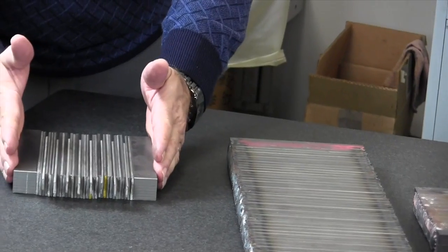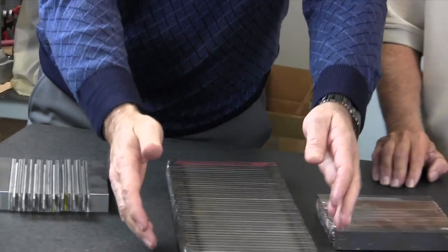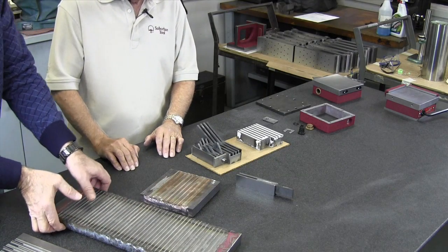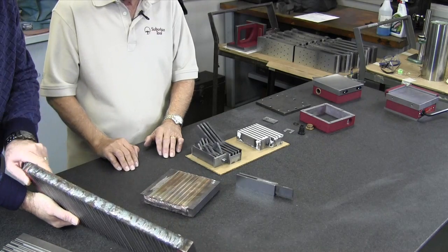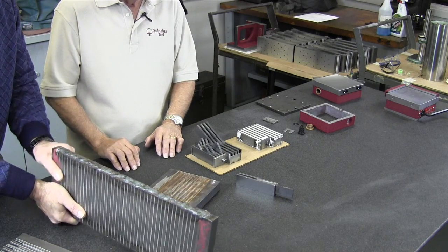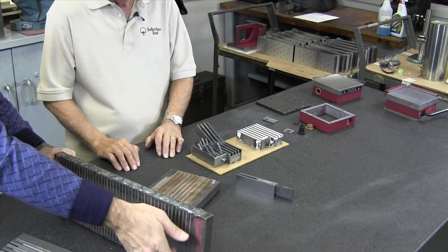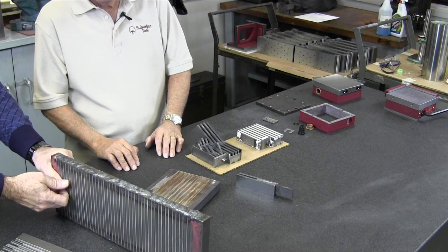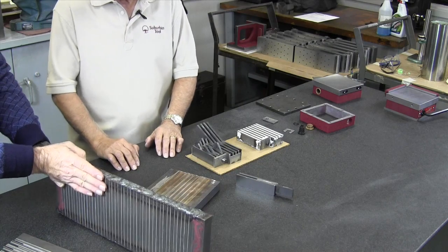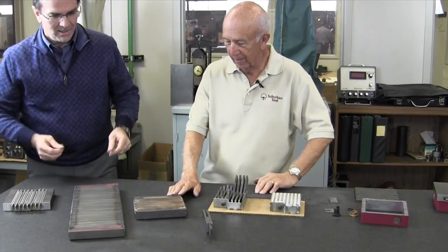We alternate steel, stainless, and mild steel — we've got both short and tall poles in here. Once that's all assembled, we have a big fixture and we pack everything in to get all those poles as tightly together as we can, then weld them down the side to hold the whole lamination together. On longer chucks, the welding causes warping, so we have to weld additional bars on the back after we've straightened them to hold them flat for the next process.